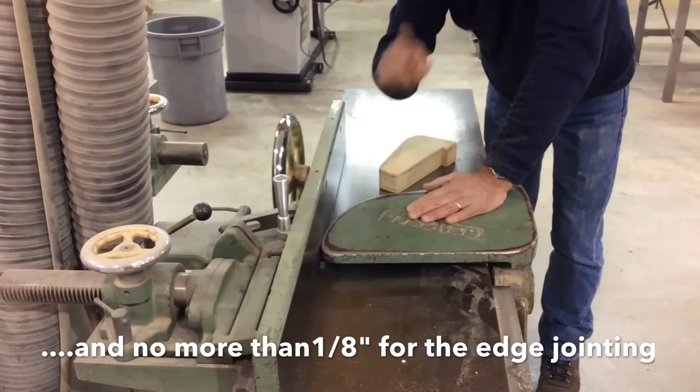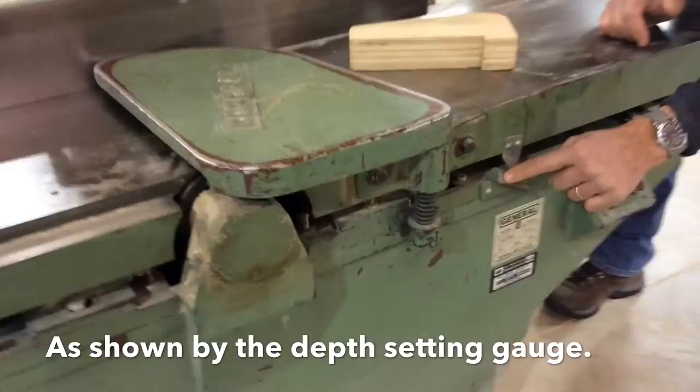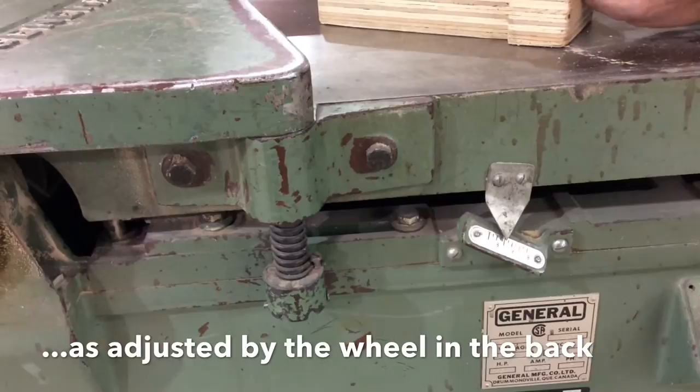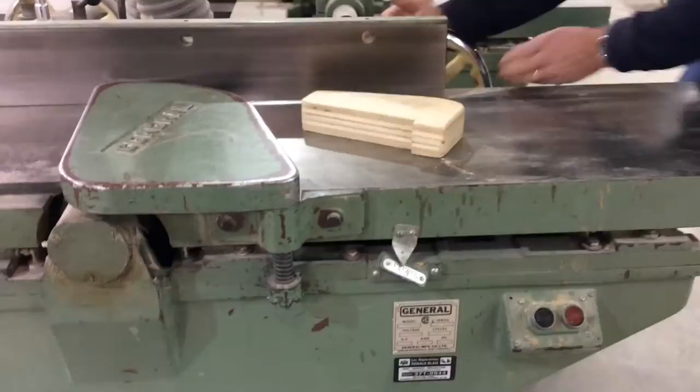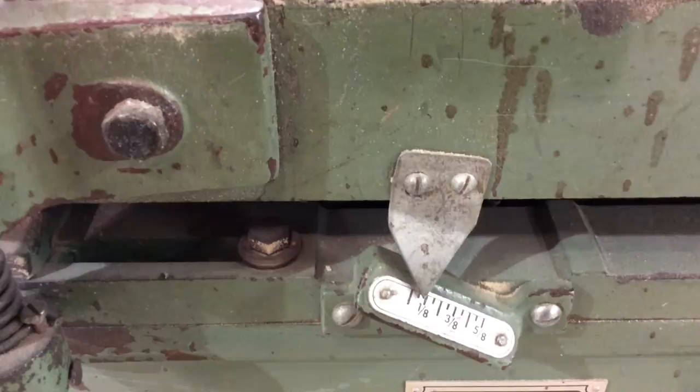How do we see that? We come over here and take a look at this gauge right here, and we can see the adjustment. So now I'm going to go back up again — I'm down around three-sixteenths, and I'm going to raise this up by turning this adjustment. And as I'm doing this, now we're down about one-sixteenth.